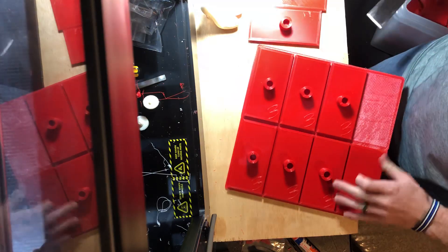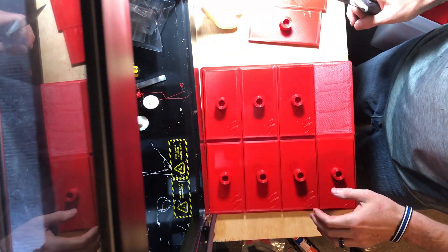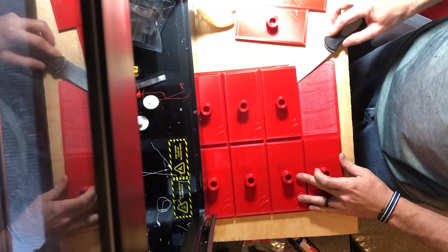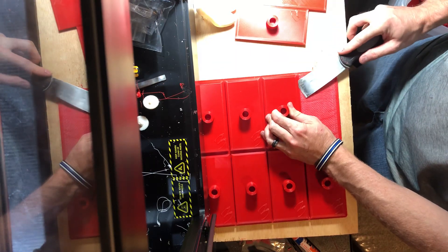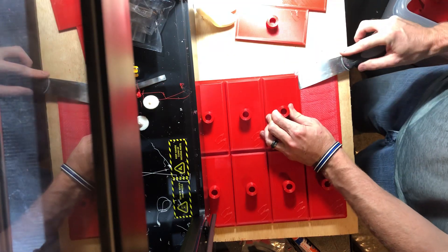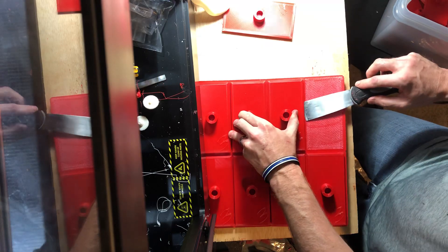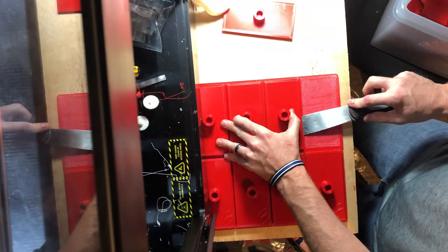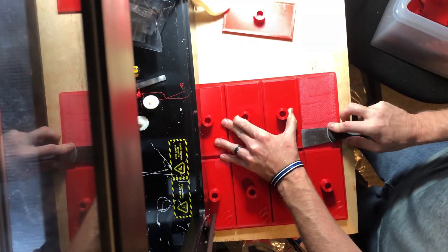A pound and a half just came off the printer and I've pretty much found the right air gap for my raft. My raft is a necessity with my end product of this part. Finding the right air gap — you can pretty much remove it, being careful not to cut yourself.